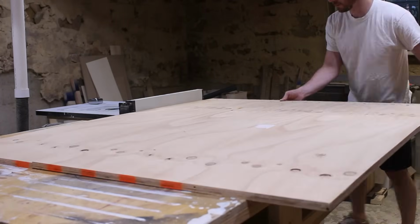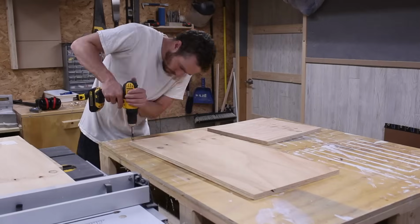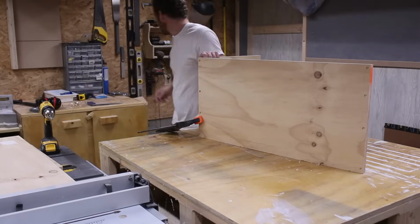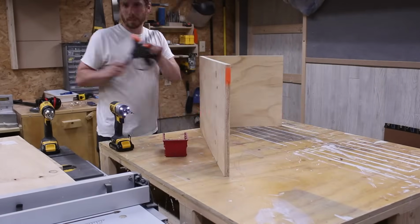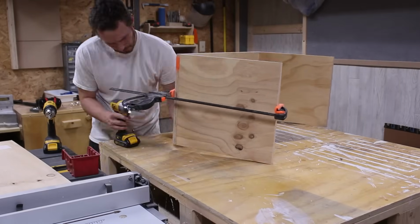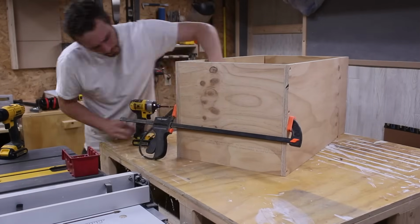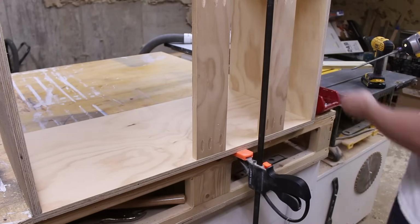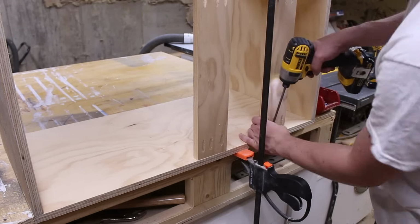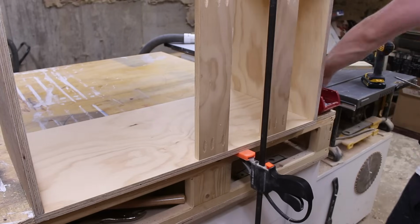I cut my 4 sides and made a box. I will be covering the outside of this with more carpet, so I'm not worried about exposed screws. I made this box wide enough to be able to fit the battery inside, as well as other miscellaneous items such as life vest, my anchor, and things of that nature. I added a couple support boards to the top and bottom for extra strength. Here I did use pocket screws instead of attaching them from the outside of the box, because if I ever need to move the support boards over, I can still access them.